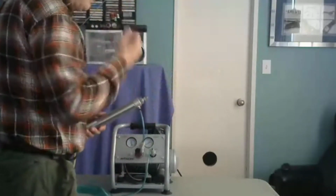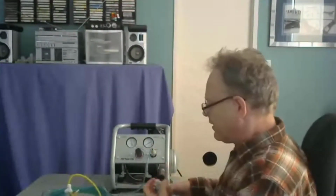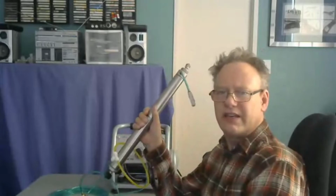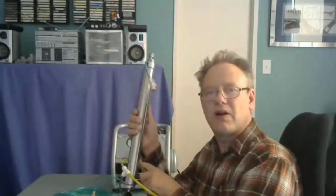Okay, that's fine. So we know that I can throttle how this thing moves. We know that I can throttle the air coming out of this cylinder. And whether this thing is hydraulic or pneumatic, the principles of control are going to be the same. What we're going to see as far as the pneumatics go is something interesting happen. We're going to see the speed of this thing change as it extends. The reason is because the air in here gets compressed.